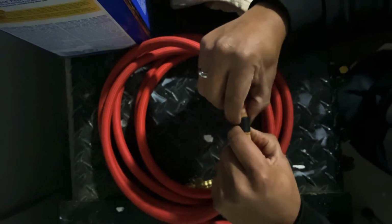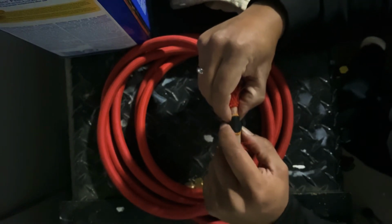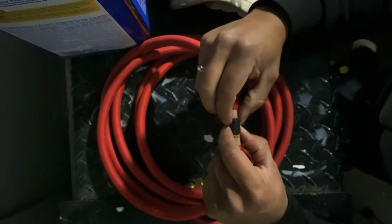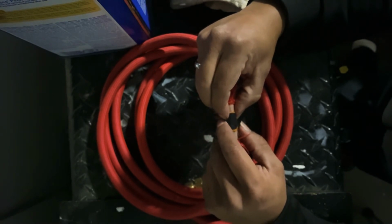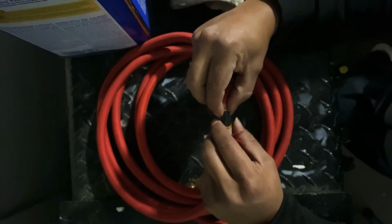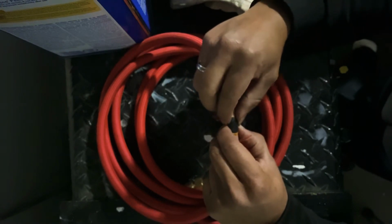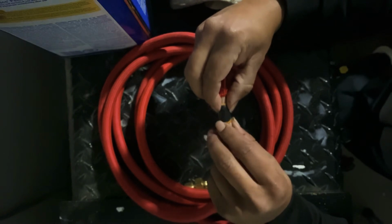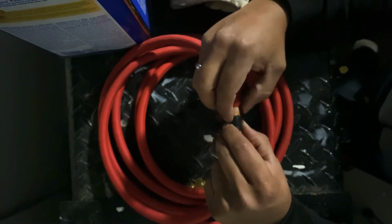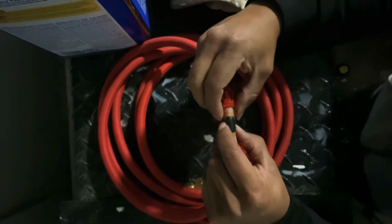Well, most of the time when I'm welding out there in the field or in the shop, I have about 40 PSI of 100% argon, max 60. Most of the places they want you to use not over 40, from 35 PSI argon flow going through, but my favorite argon flow is about 50 to 60. Some people crank it up more than that. There's regulations for all this too. You can't just crank it up like you want.